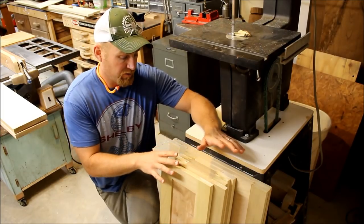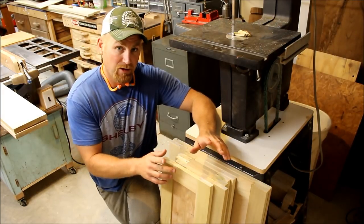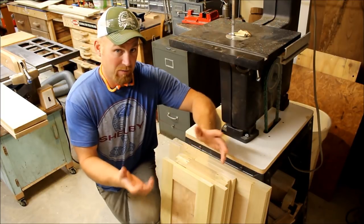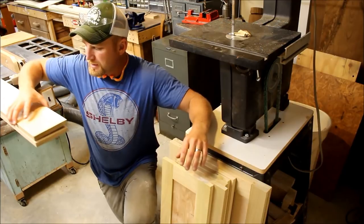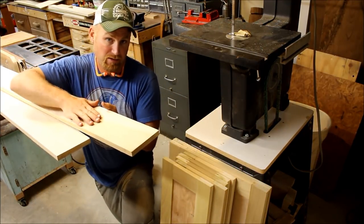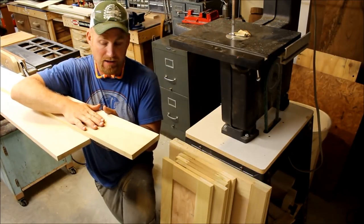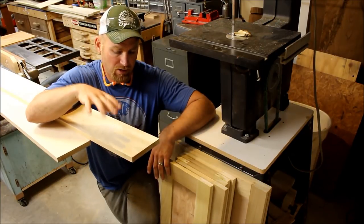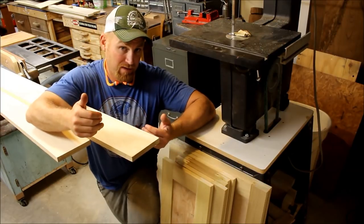For these doors, I was able to get boards that were pretty straight. When I went back to Lowe's, my local Lowe's was out of 1x3s because I had picked through all the nice straight ones. So I'm going to have to use a 1x6 and cut it down. I have 1x6s here — these are 10 feet long and were the two straightest, clearest pieces without knots I could find. I'll cut these down to size first, which will make it easier to rip than trying to rip a 10-foot-long piece.